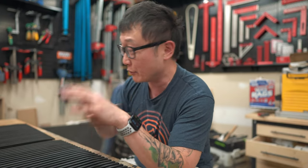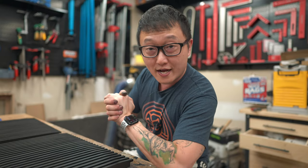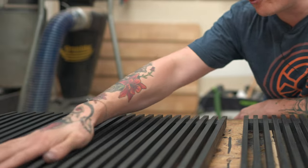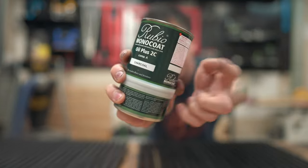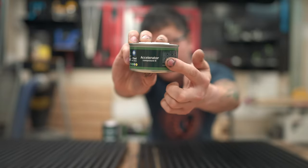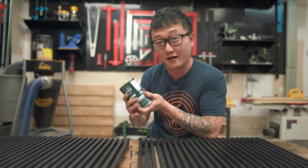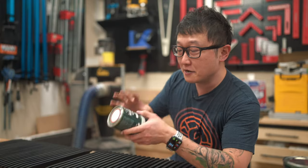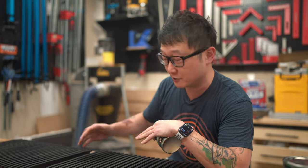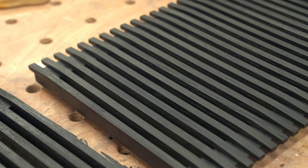Once this is all done, we should have this uniform matte look, and now we just have to wait a couple of hours for this to dry and then apply our finish. Two hours later — my highly calibrated fingertips are telling me that everything's dry and we are ready to apply our finish. The '2C' in Oil Plus 2C means this is a two-part finish: one is the actual oil and the other part is an accelerator. We don't actually need the accelerator — all it does is speed up the full cure from three weeks to about one week, so depending on what you're working on, you could save some money by just getting the oil. This finish bonds with the wood fibers on a molecular level so it protects the wood while maintaining the natural look and feel of the grain, and the stain we just applied doesn't affect it in any way.